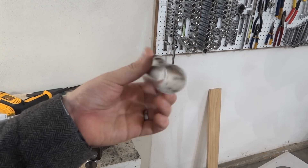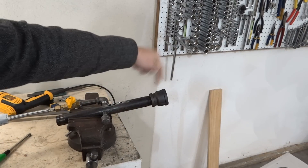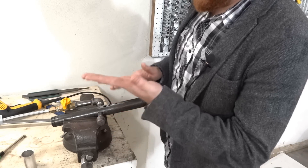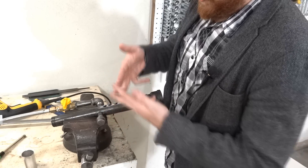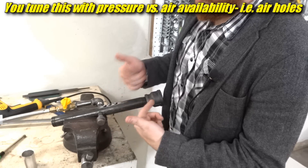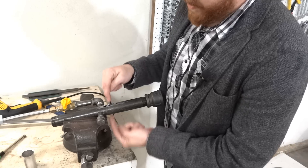Next plan — this is a little sleeve. One of the things I read online from other people who had these burners said once you get the flame pushed out to the end, it will stay there. Air and fuel are supposed to mix in there and develop a good ratio. A neutral flame has all the oxygen reacting with all the fuel. Too much fuel is rich, too much air is lean — and you really don't want lean because extra oxygen in the mix can really mess up your molten metal. We want neutral, maybe slightly rich, but we really don't want it burning inside the tube at all.